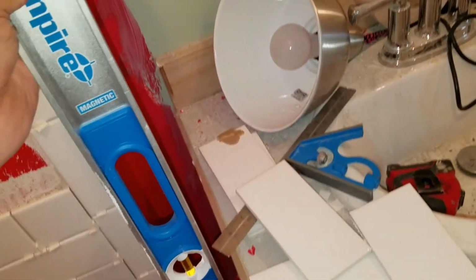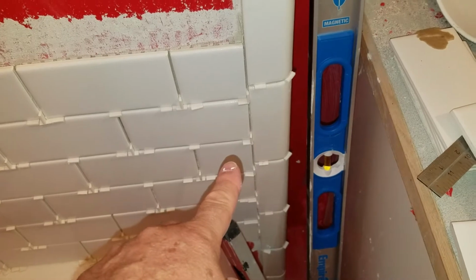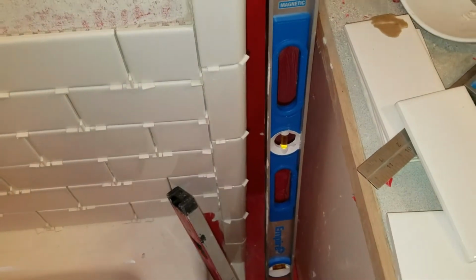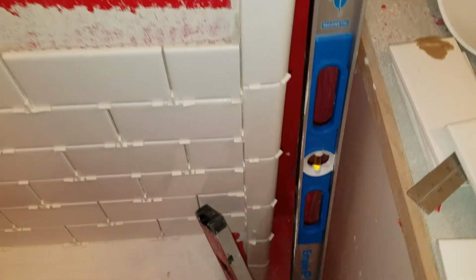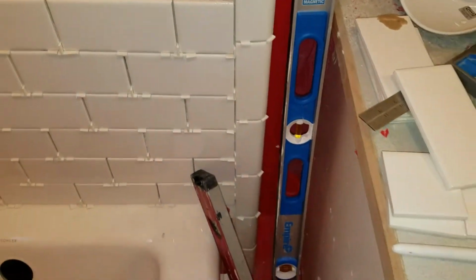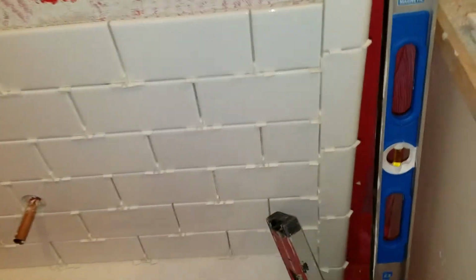Then when you do these tiles, you have to do maybe an ever so slight adjustment cut for any angle. These ones here, I have not had to do anything. So also remember, this front wall, these tiles all had to be cut up about 1/4 inch. And you can see that 1/4 inch there as this tile is wrapping around the tub.